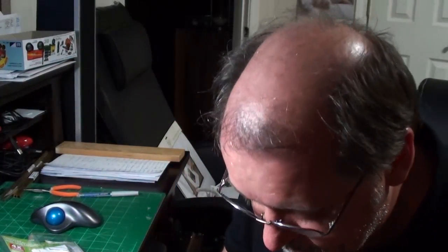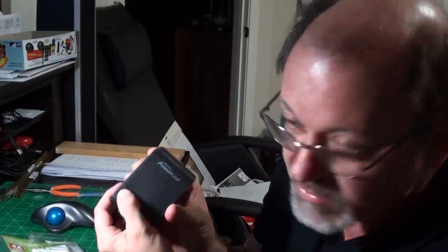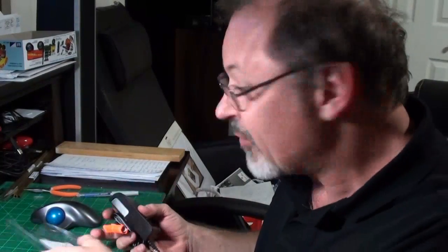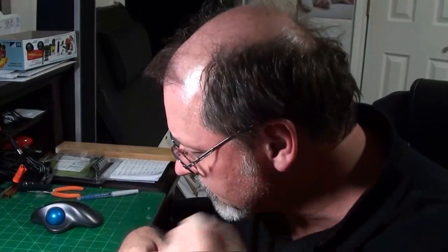So right now it doesn't sound like a mistake. You know, $20, I've got plenty of power. It's got an adjustable voltage, so I can adjust the voltage to what I want. Okay, run it at 9 volts, that's great. Here's why I said that's a mistake. I misread that at first. I thought it said 480 milliamps, which would be 24 LEDs, and that's no good for my purposes.